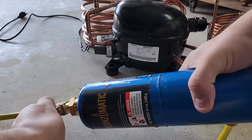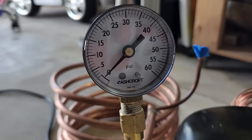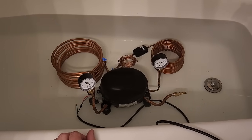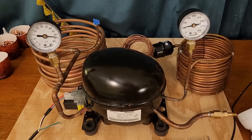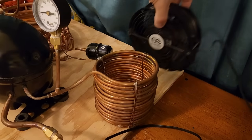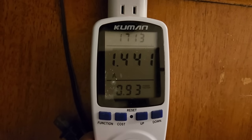For this I've got an adapter for propane bottles that connects to a needle valve and flare fitting for a refrigerant hose. On the fill side of the refrigerant hose I've got an adapter with a flare fitting on one end and a female Schrader valve on the other. Now let's crack the valve and try letting some propane in. Note that I made a mistake when I filmed this — assuming the bottle has no siphon tube it should be standing upright so that it releases propane as a gas and not as a liquid. I pressurized this to over 60 PSI and then put the entire assembly in the bathtub. Even the slightest leak would show itself as small bubbles. Looks like the evaporator pressure gauge had a small leak, but fortunately it was an easy fix. After the temperature settled, I ended up at about 55 PSI, and I'm going to add this fan to move the heat out of the condenser coil. I plug in the compressor and get about 1.4 amps, which seems pretty reasonable.